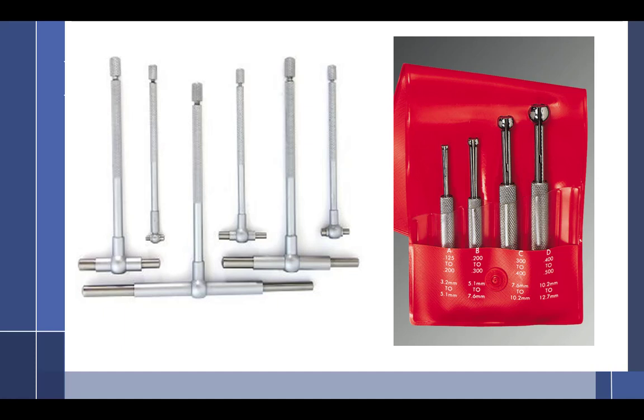Follow me? If you did it wrong, what's going to happen is it'll fit anywhere in there. Fits all over the place, and you can get it in the middle and go tink, tink, tink on both sides. You go, whoa, this is way too small. I didn't do it right. All right, so try it again. Then you put it back in. It's trial and error until you feel it anchor on one spot. Make it go through, and it should be one little spot where it just barely makes it through and drags through, and then, okay, I've got it.